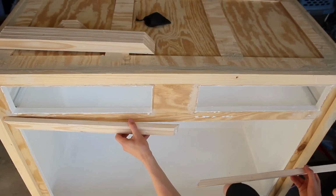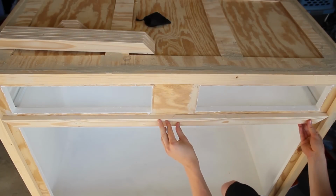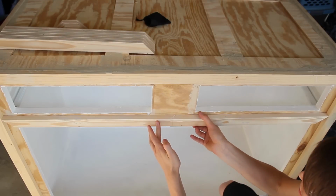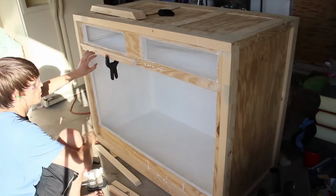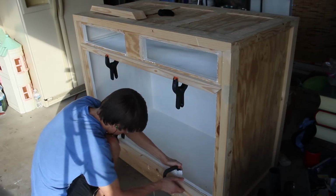As explained earlier, alone this board was too long. After making the 45-degree cut, they could then fit properly. Simply put, the 45-degree cut allows the doors to close as tightly as possible without having a center brace. So after cutting these 2 boards right in half, we ended up with 4, which were then clamped in place.